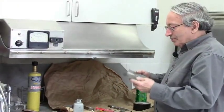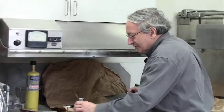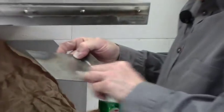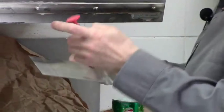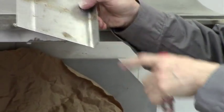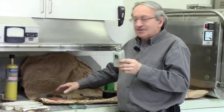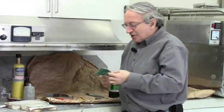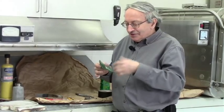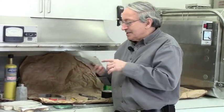Now, as a comparison, if I do the standard textbook solution and I take a solvent, say if I take acetone and I clean it with acetone and I do the wetting test, let it dry, the wetting test, it does nothing. There's no wetting. Okay? So the difference is that this just dilutes the hydrocarbons but still leaves a monolayer, while the Ajax or the Comet or these things decompose them at the end, just like soap does, and emulsifies or decomposes them, oxidizes the residue or whatever chemistry takes place, and leaves a surface with high surface energy.